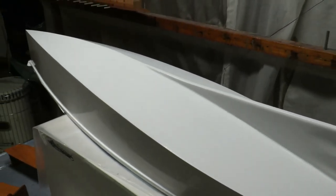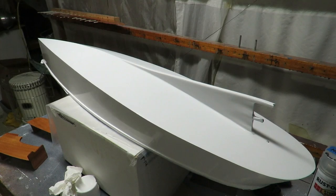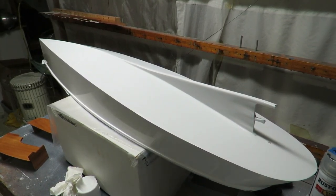And we're going to go back to a bright, shiny finish. But we'll finish up with the 600 grit, so there's no stippling on the bottom and then the sides. And then we'll move on to 800 grit, and then 1000 grit, 1200 grit, 1500 grit, then I think we can jump to 2000, and then 2500, and then we start with buffing compounds. We'll go with a buffing compound that almost overlaps the 2500, maybe a little bit finer than 2500, and then I think the next one's probably about 3000, then 5000, and the finest one is probably about 6000 grit. It's quite a fast progression because such small steps, it doesn't take much to finish each step and move on to the next one.